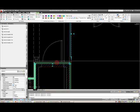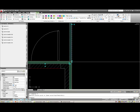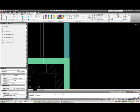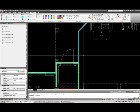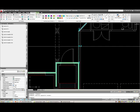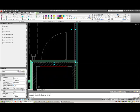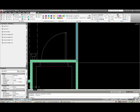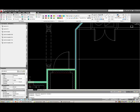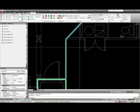The base line is important for walls to clean up when they intersect one another. So if I select these other two exterior walls, the base line meets at this point right here. If I drag this down with the base line on this side, you can see there's a red line in between the two because these walls aren't cleaning up. If I select this and flip its base line, this base line will join the end points of these other base lines and actually clean up the walls. So when we draw these interior walls, our goal is to get the base lines to touch one another and their end points to touch, and that will cause these walls to clean up.